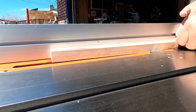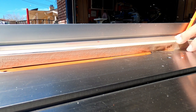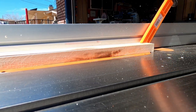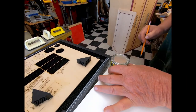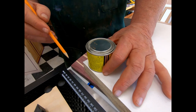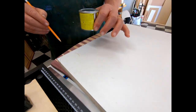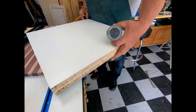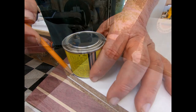First step is to cut some maple for the stop fence that will prevent our sled from sliding all the way across the table. We cut our table piece out to be 18 inches by 18 inches, and we're going to round the corner, so all we're using is just a putty can to give our rounded corner mark. And we just go around marking all four corners.